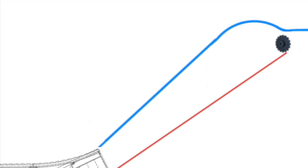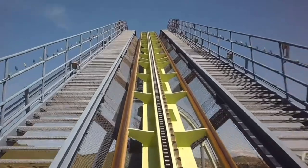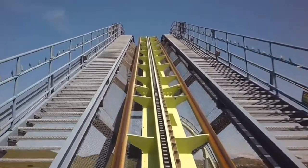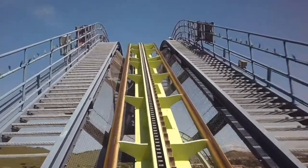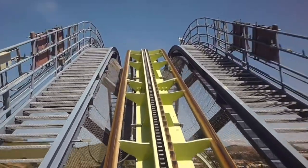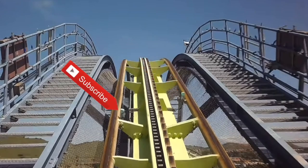Now, lift park is a controls term, actually, because there's nothing defining lift park except for some proximity sensors. At the very top of the lift hill, as you're going up there, before you go over, you're still on the graded surface. You come across these sensors in the track, and that is lift park. That is the edge of your block zone.